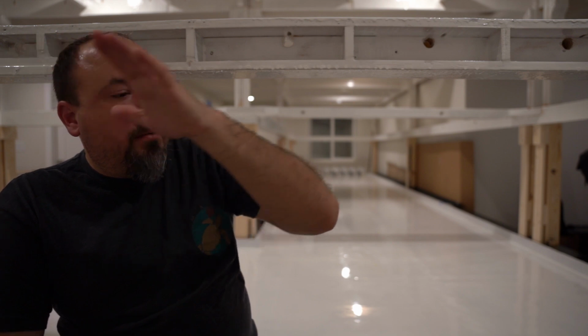So overall, the waterproofing all turned out really good in here. A couple lessons learned, I'll say though, is with the Pond Shield on the fiberglass, the one thing I have noticed, and it's something I kind of expected, is that because it's not wood where it soaks in, if you take something really heavy like a sawhorse or a hammer or something and you strike it at an angle or drag it across with a heavy weight, there is a chance that you could tear the Pond Shield epoxy. I had a couple little instances of it.